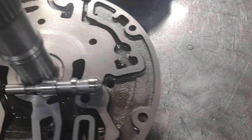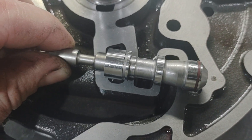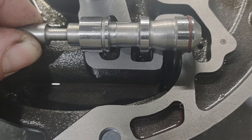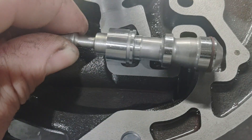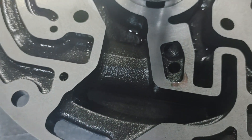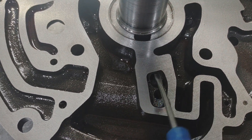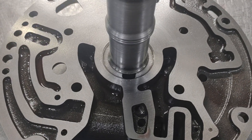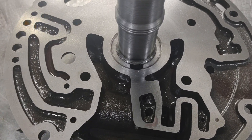That covers that and why you can have some problems on a 4L80 with trying to lube. If you look at a TH400 pump, it's very similar. The 400 regulator valve opens up, starts to regulate, and recirculates the fluid from the line pressure side back to the suction side. When it opens up, at the same time it regulates oil from line pressure into the converter charge circuit. On the 400, it goes through this passage and comes out here, around the outside of the stator to charge the torque converter — a much simpler converter circuit, but the way it originates at the regulator valve is the same.